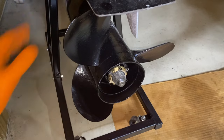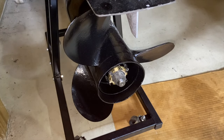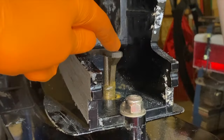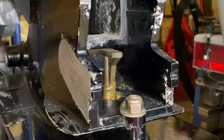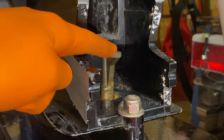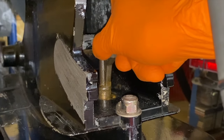It's important that as you shift the out drive onto the transom and bell housing, you do not rotate the propeller in the forward motion or clockwise. That will offset the shifter on the opposite end of the out drive. Back to the side with the yoke shaft and U-joint assembly — if I move the propeller counterclockwise, that shifter does not move. However, the second I rotate the propeller clockwise, you will see this shifter move. It is now offset and will literally be impossible to line up with the lower shift shaft guide on the bell housing, making it impossible to get your out drive fully installed with the yoke shaft flush with the inner engine coupler.